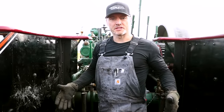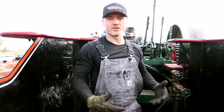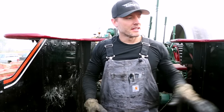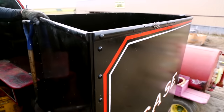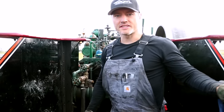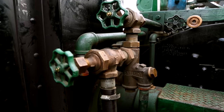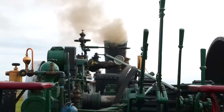Where I'm standing right now is actually the fireman's platform. This engine was designed for heavy freighting road locomotive work and plowing, and it took two operators — the fireman here and the engineer up front who drove the engine. On the sides you can see coal bunkers, designed for doing freighting over long distances with a lot of capacity for water and coal. Directly under where I'm standing is the water tank, which holds 650 gallons of water. We use steam injectors to take water from the tank and put it into the boiler using the steam pressure.